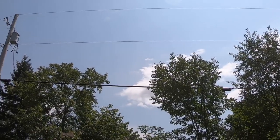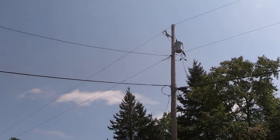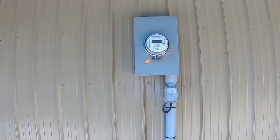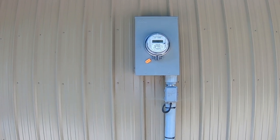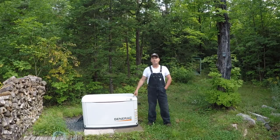When you've got a utility power outage, the system will immediately — within milliseconds — see that there's a loss of electricity and signal the generator. The generator will fire up and power your home, or parts of it, as you've determined with your installer. When utility power eventually turns back on, that transfer switch will immediately see the new signal and shut off the generator.